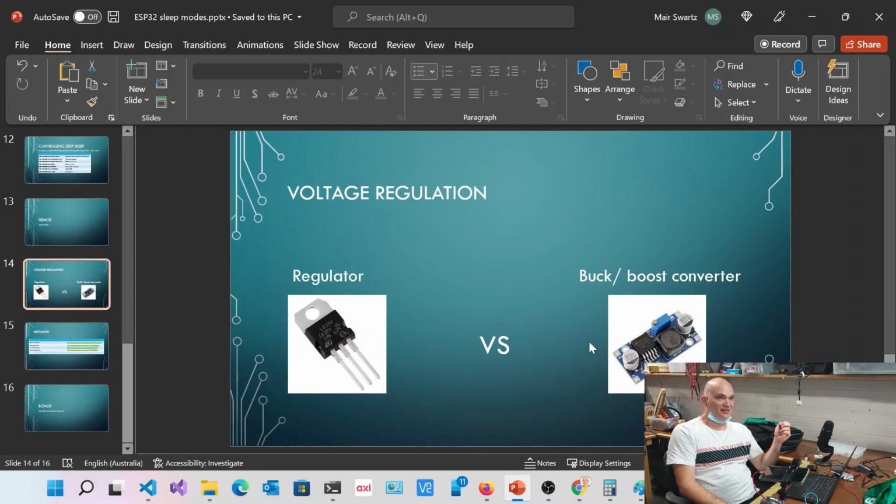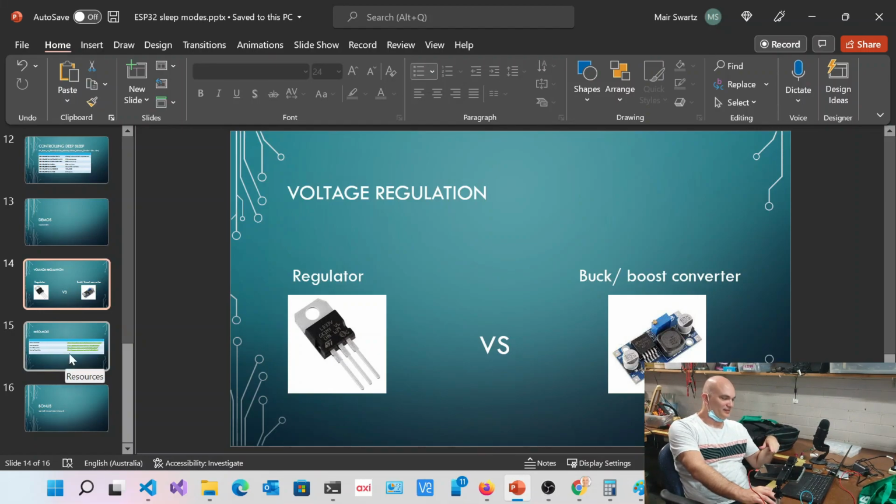Yes, because they're basically MOSFETs, aren't they? Yeah. Because they're high-speed switching, the switching creates resonance waves, and if it's propagated along the wire, the circuit turns into a transmitter, and if it's in the 100 megahertz range or whatever, it can interfere with aircraft, etc.